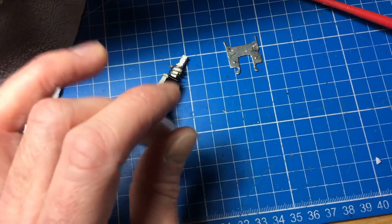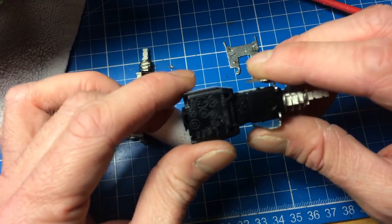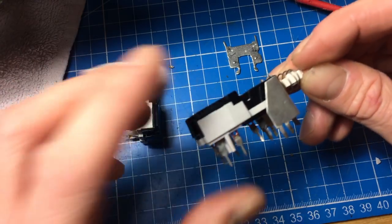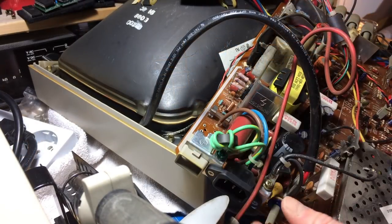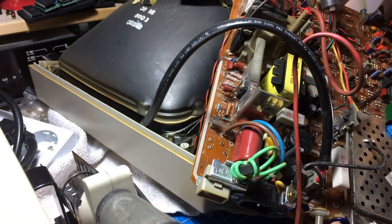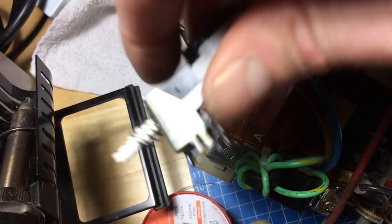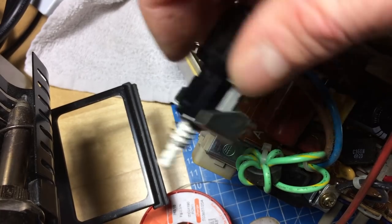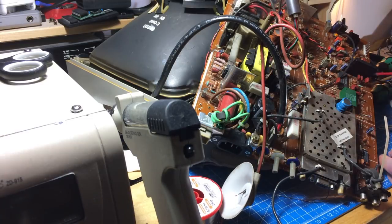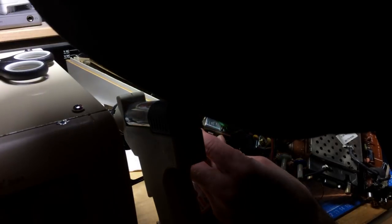Bending it into shape so it fits over the switching mechanism. These are TV switches — standard switches for televisions and monitors, as we've seen. The contacts have little rings around them so they can take a lot more current. There's nothing where the secondary switch contacts go, so I can just bend them inwards and insert the switch. I'll bend the extra contacts inwards so we don't destroy them, in case we ever want to salvage the switch.